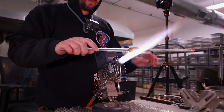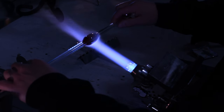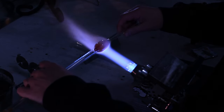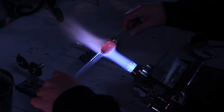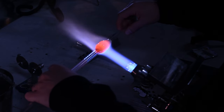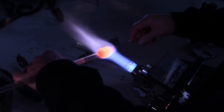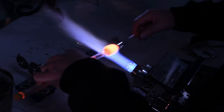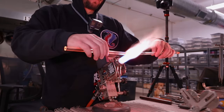I'm going to bump up to a big flame and build a lot of heat into this and stretch it down eventually. It's important to keep this really straight, so I'm going back and forth with my hands — not rolling one direction. You can see the glass is starting to accept the heat. Once I have a good heat base in there I'll start to give it some pulls and see where my heat base is, going back and forth when it gets soupy like this.